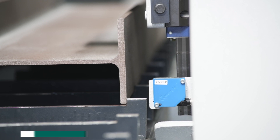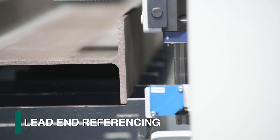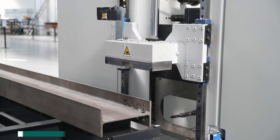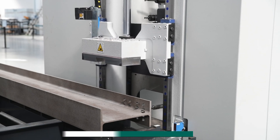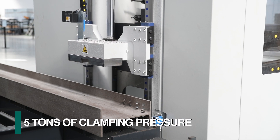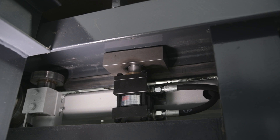As the cycle is initiated, a non-contact photo cell detects the leading-end reference of the actual section's location. Once the drill is positioned to the programmed location, the material clamp, with up to five tons of adjustable pressure, pinches the section from the top and bottom.